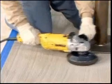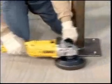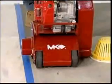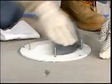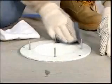Good preparation is paramount to successful application. All surfaces need to be free of all loose material, and concrete needs to be mechanically ground clean. Any metal must be power brushed to bare metal. All drains must be ground and cleaned and chemical wiped to remove dust.